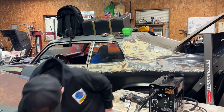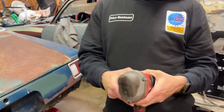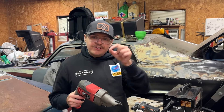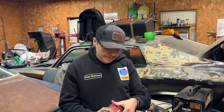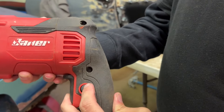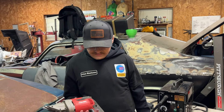The next tool is the Bauer electric shears, and I fell in love with this. These things are great for sheet metal — we've used them for fireplaces, cars, all kinds of things. It will cut up to 16-gauge metal and cuts a pretty straight line. When using heavier metal it's a little harder to push through, and you do get little metal strips left over that can cut you — but it works really well.